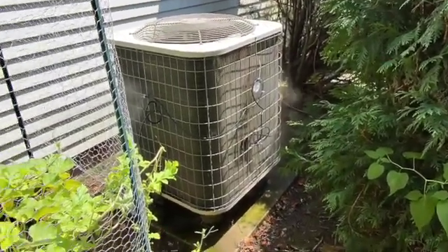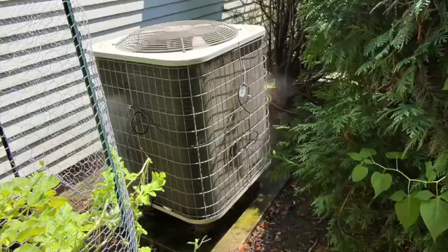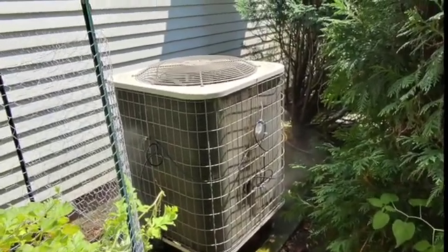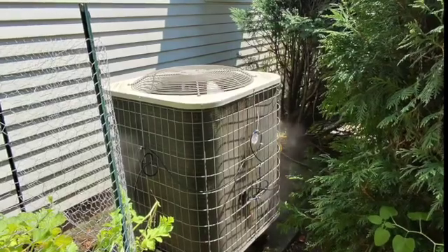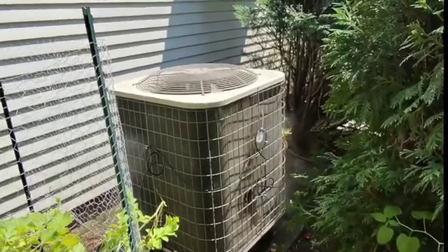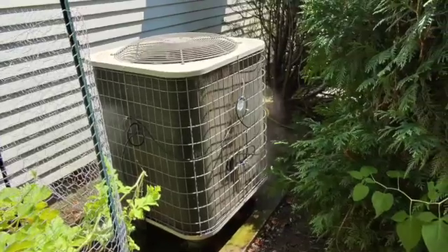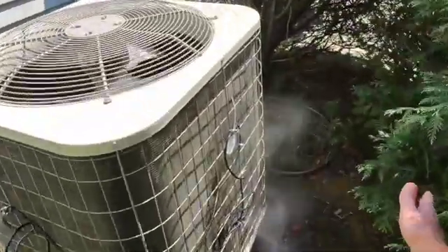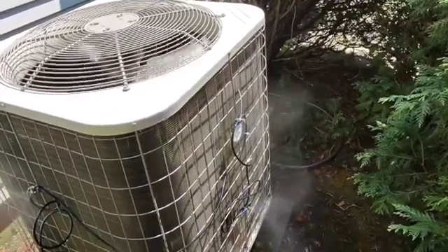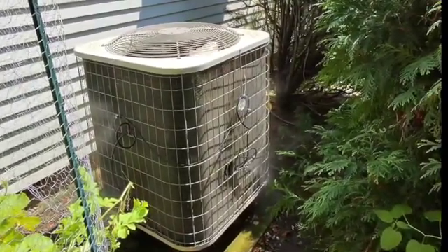Number two, I did hear everybody's concerns about the scaling that's possible with some of the residue minerals left behind after the water evaporates. I'm going to be adding a filter — I'll show you that. And after that, I want to try a couple of things that viewers had suggested: the first being some sort of shade as an alternative or addition to the misting, and the other one was to move the nozzles out a little bit so that as the water gets sucked in, it has a chance to atomize and increases the effect of the water evaporating on the condenser coils, which is what really causes those coils to cool down.